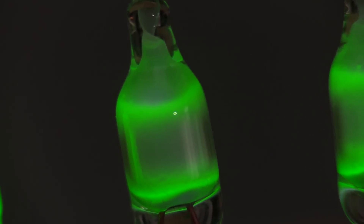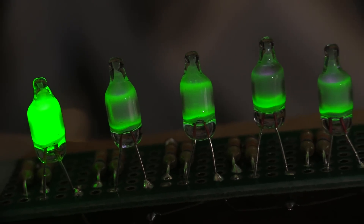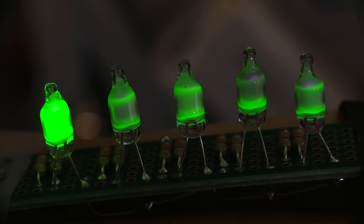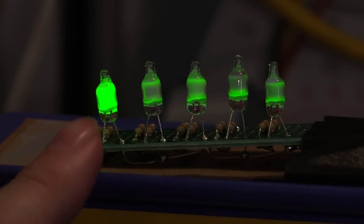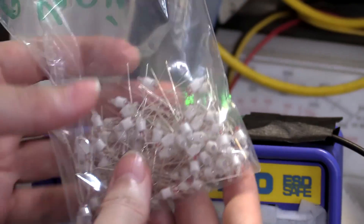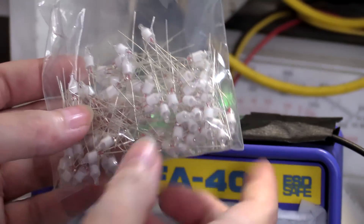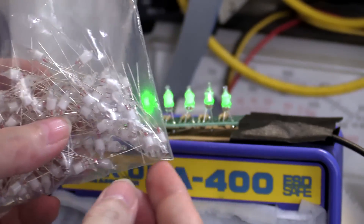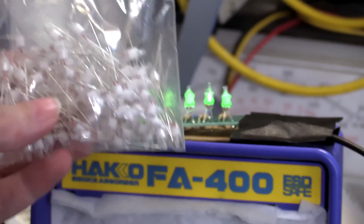These two here have no neon glow at all — that's probably just argon and mercury, maybe a little neon as a filler gas. You need a little neon to start up the plasma because you can't get argon to ionize at 120 volts — you need a lot more energy than that. There's obviously some mercury in there to lower the conductance in the gas, so it's probably a combination of neon, argon, and mercury. It's the UV from the mercury-argon mixture that is activating the phosphors, but these phosphors are now destroyed.